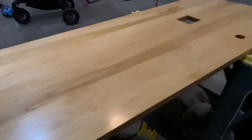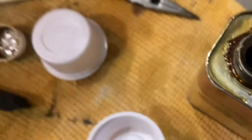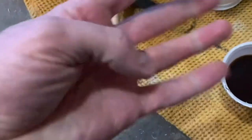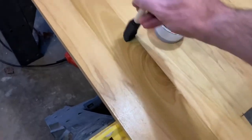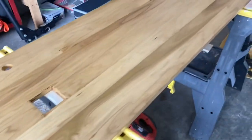After my third coat, I noticed my fourth coat was kind of unnecessary — it started to slosh around and I could tell it wasn't really penetrating. I think it sealed pretty well after the third coat; I put a fourth on just for kicks and giggles. I'm pouring it into my plastic container each time — I used a little juice container from my kids, rinsed it out really well, and that served the purpose. That last coat dried really well and really evenly.